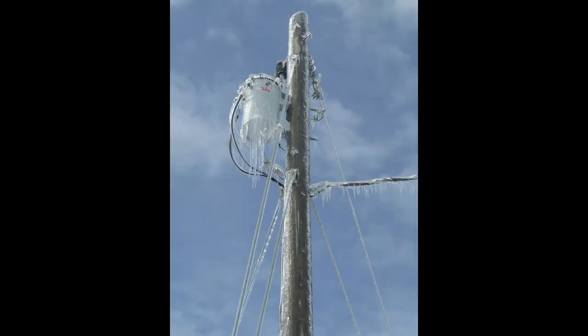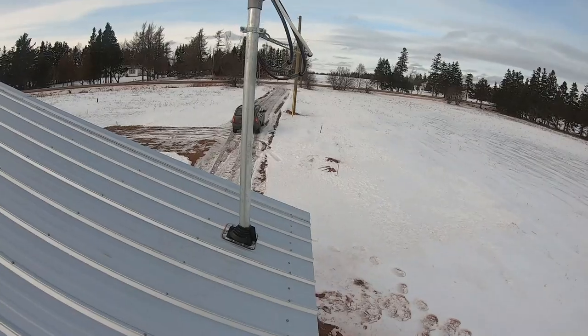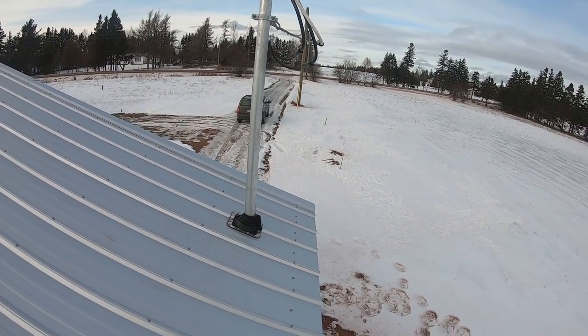Well, hello rovers. Today we are expecting a big storm — this is really the first proper blizzard of the season. We're expecting about nine inches, maybe as much as a foot. It's going to come in very hard and fast, and then sometime after midnight it's going to change over to freezing rain. These are the things that worry us, because freezing rain when it builds up on the electrical wires puts tremendous strain on our service mast, which brings electricity into this building. So in order to support that, I plan to put a guy wire back from the mast to that eye bolt.